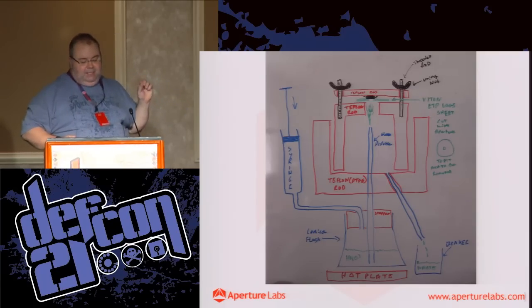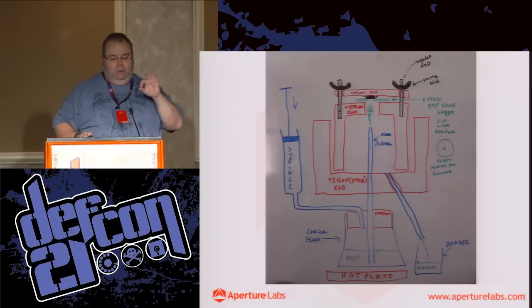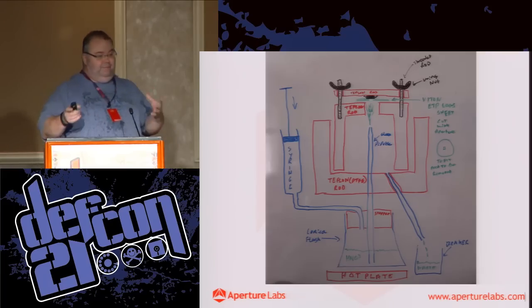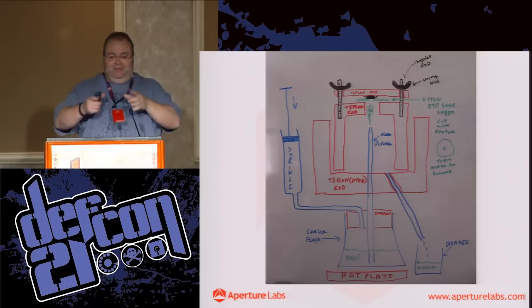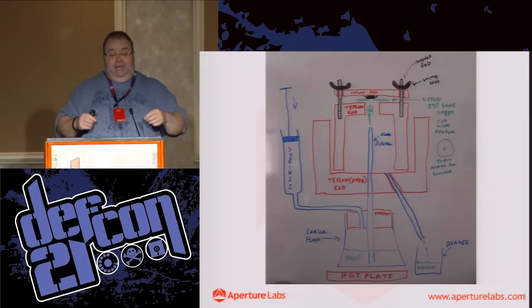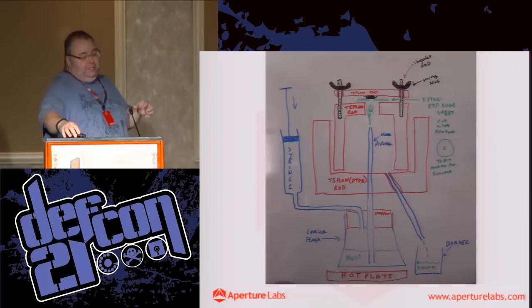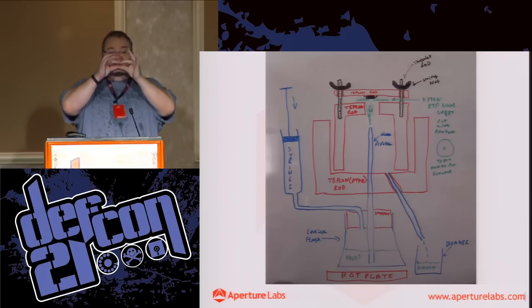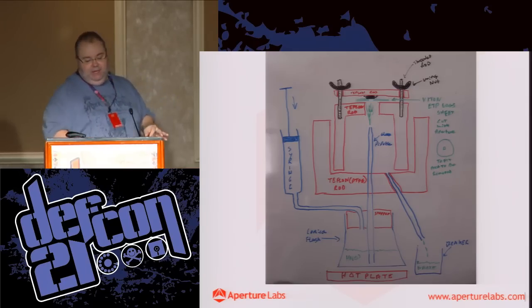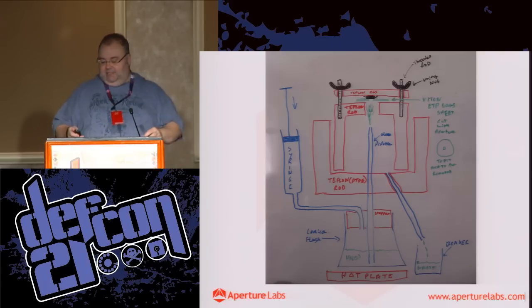And I also realized that once you cut the aperture in the Viton, a handy thing to do is to super glue it to the chip. So therefore it becomes a kind of monolithic thing, and the Viton isn't going to be slipping off the chip. And I ended up using little strips of Viton with the hole cut in the end so you could put it in and line it up with the aperture that the acid is going to jet through.